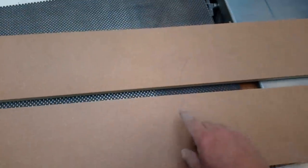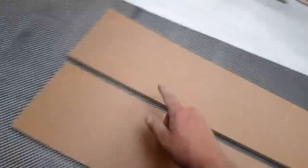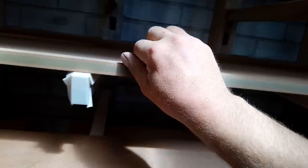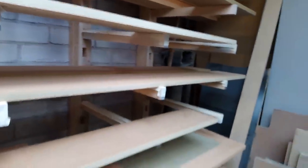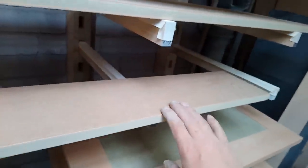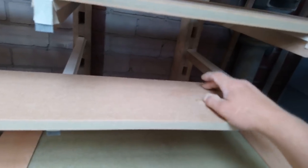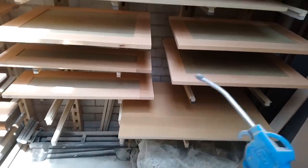They're done. I'll put a little mark to remind me that's the inside edge and that's the top. These are kick boards - I'm just going to take the sharp edges off them. I might be cutting them anyway, but I'll spray one edge just to seal it when it goes down to the ground, for when you mop the floor. These end panels I'll spray the top, but when the bottom gets cut I'll seal that with some paint. Before I start spraying - I'm going to spray a bit later, in an hour or two - I'm just going to blow everything down, even the stuff up there.